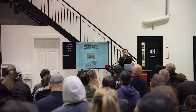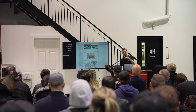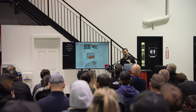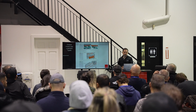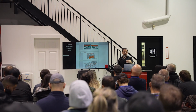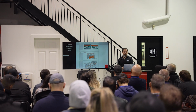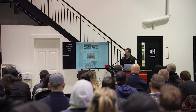We've got grease points on the cap. So that cap, when the carriage is moving, it moves with it as it's capping. So you don't want that to get dried out, or else you may have an issue with the capping position. And then we've also got grease points on the wiper. So the wiper's automated, it comes out and then wipes. As it's moving in and out, it's removing some of that grease. It's drying out. So there's some grease points as well on the wiper system.